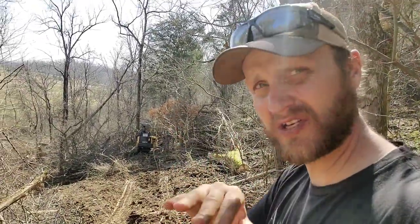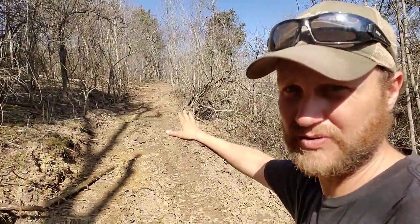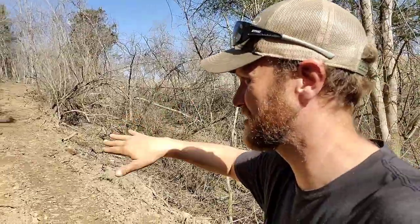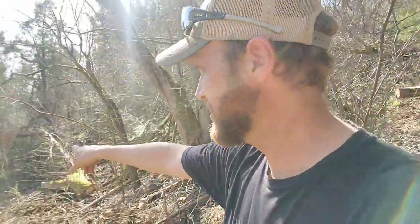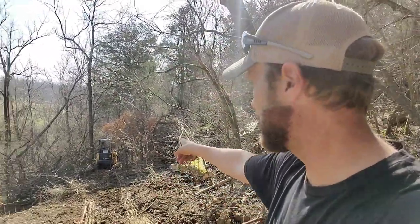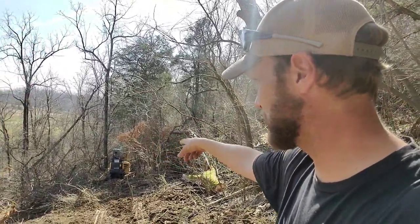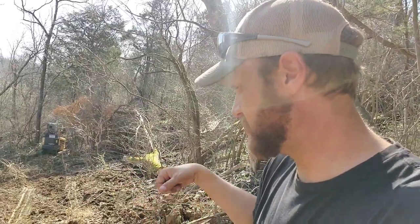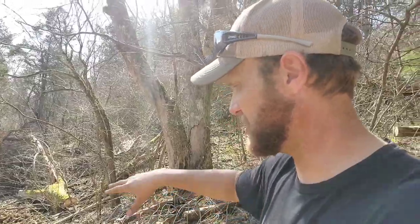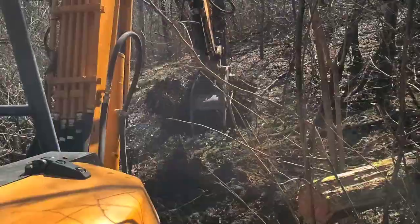We do exactly what we're doing here with the mini. I mulched it to this point last year. I could have maybe left this the same since my mulcher Paul already mulched it, but to make it safer and faster I took the dozer in because I needed to get the mini to here. With the mini excavator — thumb and blade on it, something big enough with some power, 10 to 12,000 pounds; that's a 9,000-pounder, a little small — he goes in and takes dirt from the top side. The slope's like this, he brings that dirt toward him, puts it in his left track. If it's steep, you take it out of your right track, put it in your left track, compact it in, and that keeps the machine level.